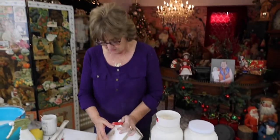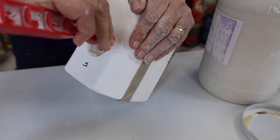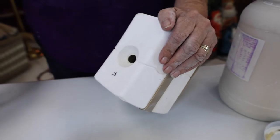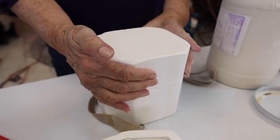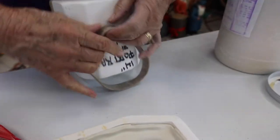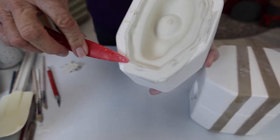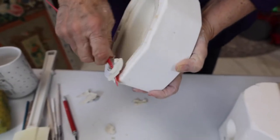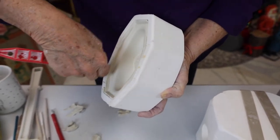What you're going to do is clean the pour hole out — you've got to be careful here again. Remember, you were studying your molds. See if it's dry enough. I'm going to put it down and see if it's ready to go. If I can lift it up easily — no, it's not coming. That's okay. Re-band it and wait. But this needs to be taken care of. See how it's starting to separate right here? That's good, but I'm going to clean it off too. Remember, I said this is where it ends — right there.